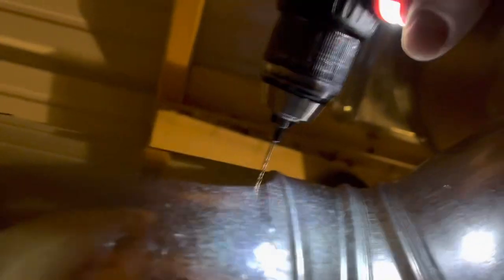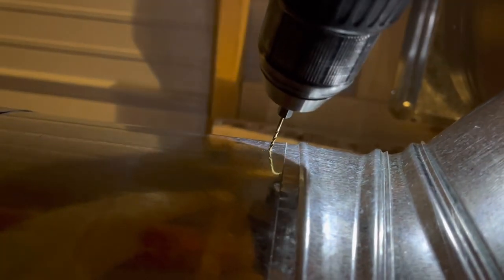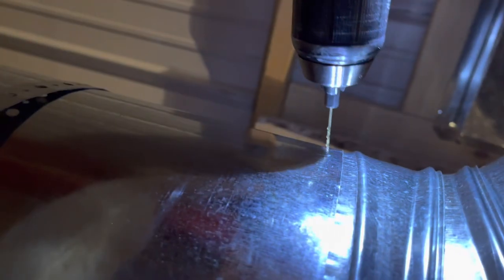What I like to do is take a drill with a tiny little bit and drill a tiny pilot hole — just like that. You don't want a big pilot hole because they're self-tapping screws, and if you use a big pilot hole you mess up the screw. So that's how you do it — now I can screw this in just fine and it'll work perfectly.